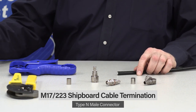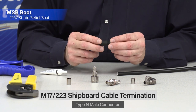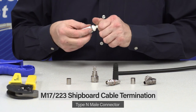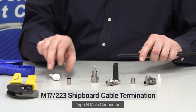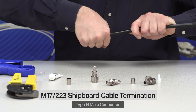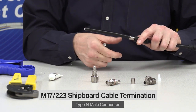For these connectors we have what we call WSB boots — they're strain relief boots and also IP67 boots. Take a little bit of silicone lubricant, place a couple drops onto the cable, take the boot and get it started. Once it hits the lubricant, slide it back a little bit, then take your crimp ferrule and slide that crimp ferrule back.